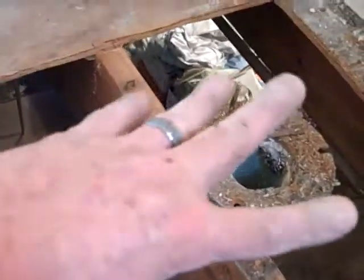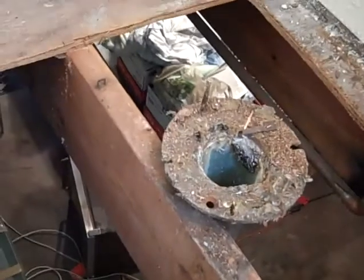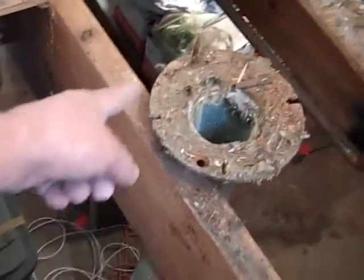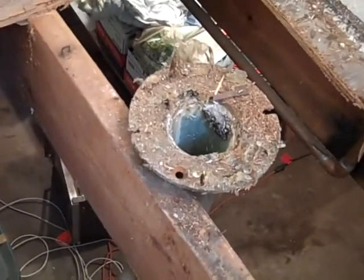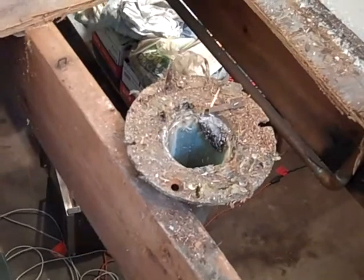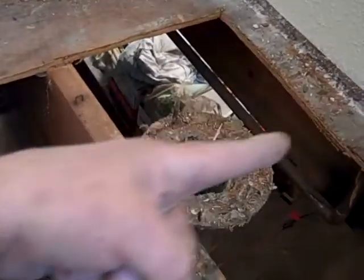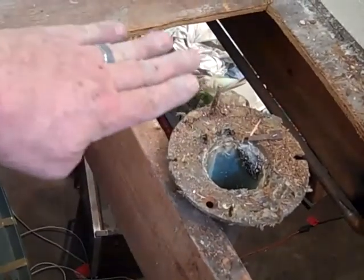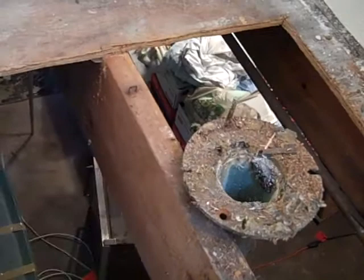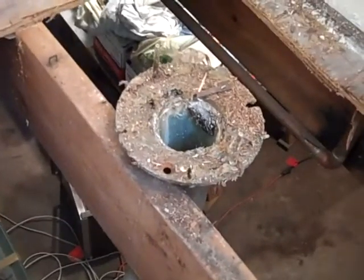Then these 2x4s. See, and also, I want to cut a circle in this plywood. The trouble is, I don't want to cut it this size. I want it to go underneath. So the only way to really do this the right way is to cut this piece of plywood long ways. In other words, there'll be a cut right down the middle this way. So half of my circle can scoop underneath this way, and half scoop underneath this way. I'll show you what I'm talking about when I get it cut.